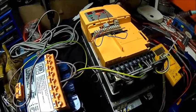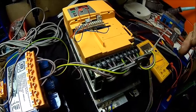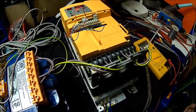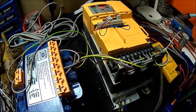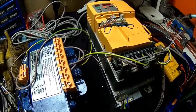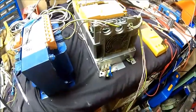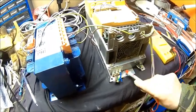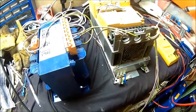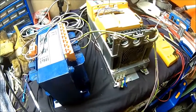There is another possibility: you can get a 230 volt inverter and put a three-phase transformer at the output, so your inverter will constantly see a load. At the end of the day, this setup has been proven to work for a long time — I use it on my shaper, compressor, and other machines. Make sure you ground everything. There is a mains filter underneath that should be connected because the input makes noise — you don't want interference on radio, TV, or mobile phones.